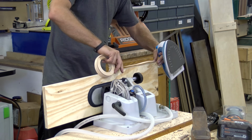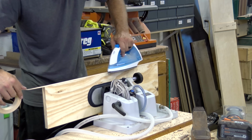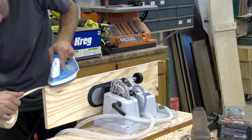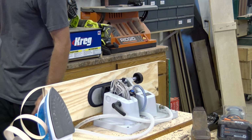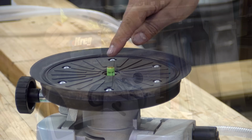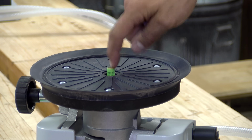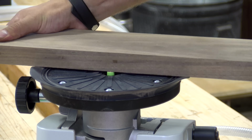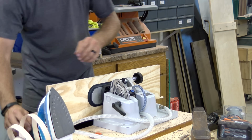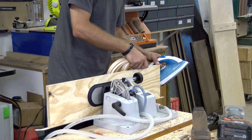The concept for Festool's vacuum clamping system is extremely simple and easy to understand. The vacuum pump draws a vacuum on the two VAC-SyS SE1 and SE2, or one or the other depending on what you have. There's a green plunger on top of the clamping cup, and once that's depressed, the vacuum draws atmosphere out of the cup, and then once you have it sealed with your material, it has a really strong holding force on the clamping cup.